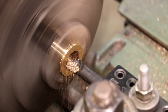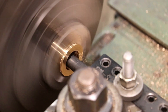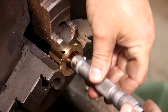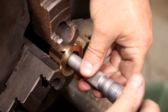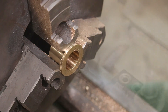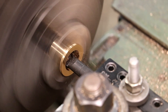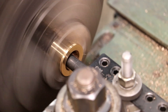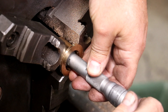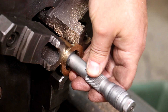Do another 60 thou. We're at about 960 thou — about 40 more thou to go. That's a little over half a thou over — that's exactly where I want to be. I think this one's done.